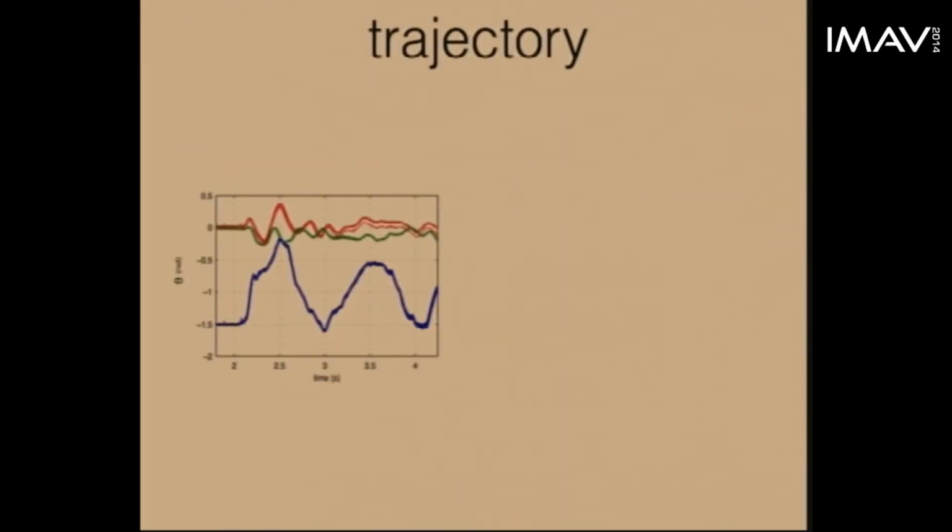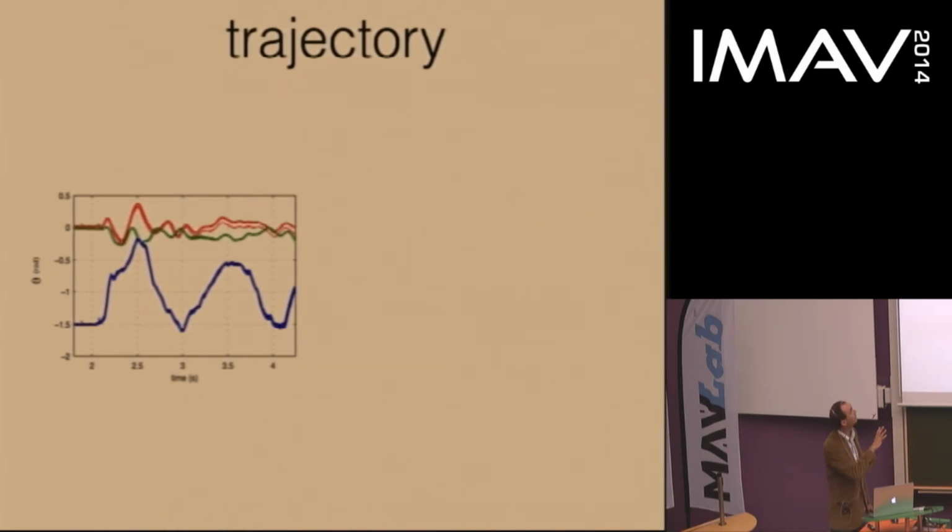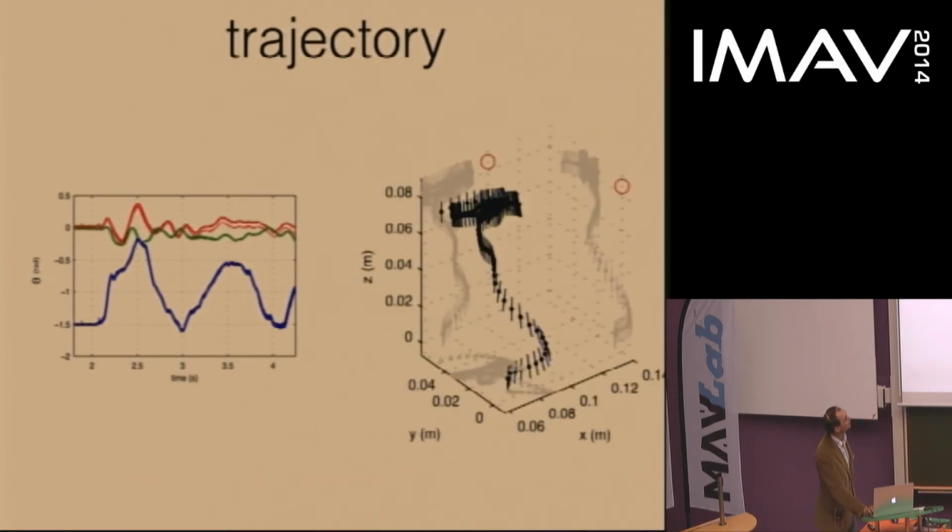So this is the readings from the gyros over time. The Euler angles estimated over time, and what you can see is there's a little bit of drift. But for the first 2 seconds, the vehicle hovers pretty successfully near the set point, though with a larger error than in the previous case, presumably because the estimate was not perfect during the time.